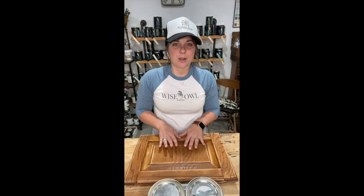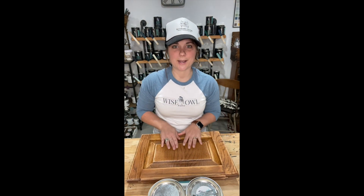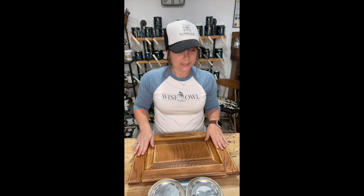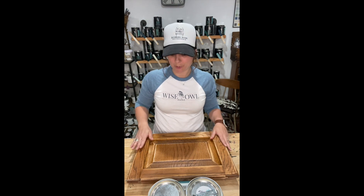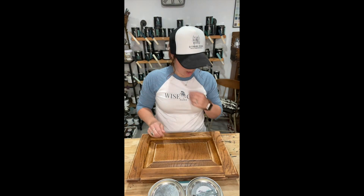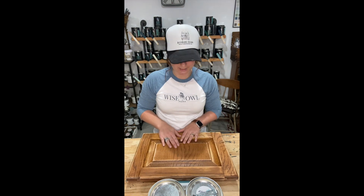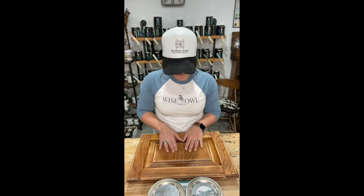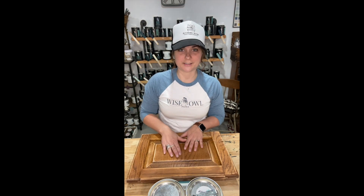Before we get started I want to explain what I've done with this sample board — this kitchen cabinet door — so you guys know exactly how I went about prepping it before I go ahead and start priming. What I did is I took my sander — I have a Surf Prep Pro — and basically scuff-sanded to get off any kind of sheen that's still on here, so mostly all the sheen and the top protective coat is gone. It also gave me a nice smooth surface to start working with, which is great.